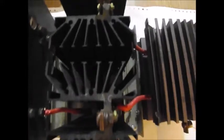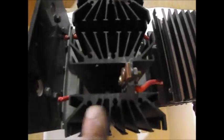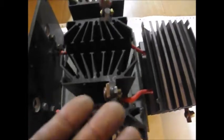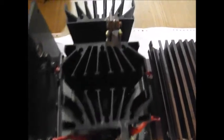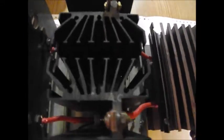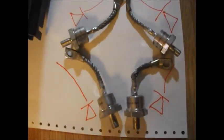Now depending on what kind of amps, that will determine what kind of heat is going to be developed from down inside there. And then the aluminum itself is going to take that heat in, absorb it, and then emit it out the top, because heat rises up. This way the diode itself — the individual one — doesn't develop too much heat and burn out and cause problems. You want to be able to get rid of that heat.